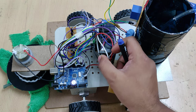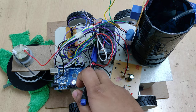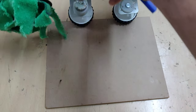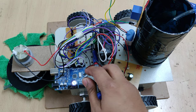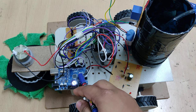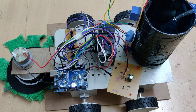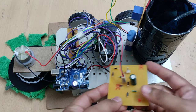By turning on this switch we can power on the full circuit. The L293D controls the robot body; below it we have 30 RPM motors. These 30 RPM motors are controlled by the L293D motor driver based on commands from the microcontroller, which are sent from our mobile phone.